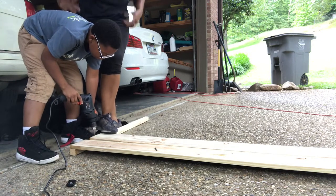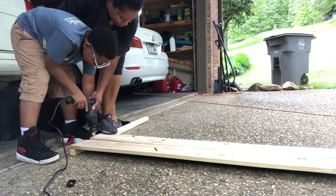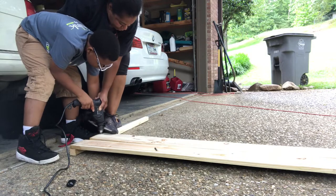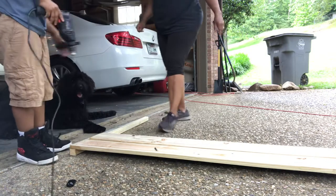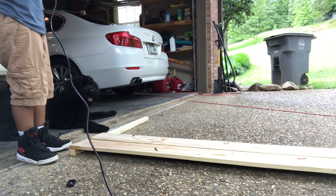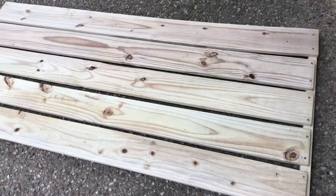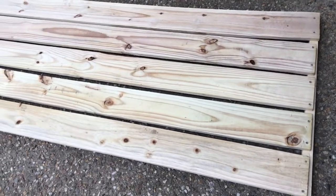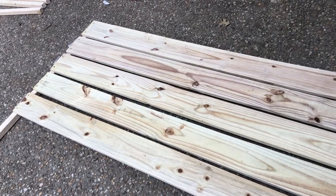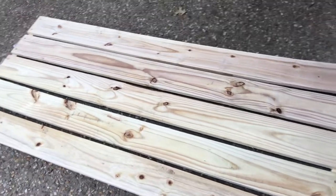That board is short — don't go to the edge. We have the first six-by-three enclosure. The other side is finished. I did miscalculate, so that side is going to take five boards — five times six inches is thirty — and then we have an inch space in between, so we're at thirty-four inches total.